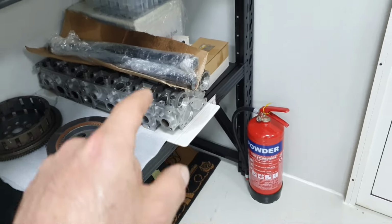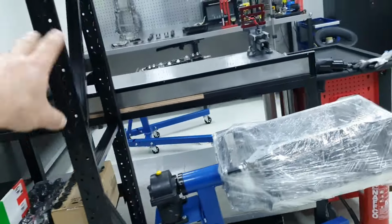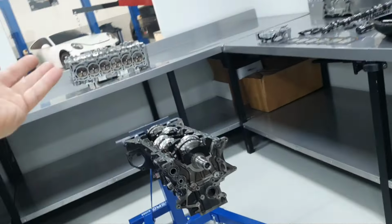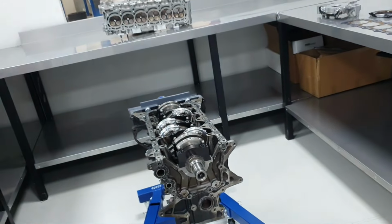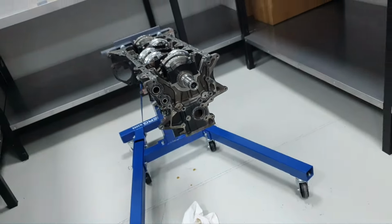I'm going to ask the owner, my friend, if I might use this cylinder head instead of this one. If there's no need for lapping, if the valves were okay and not leaking, I'm going to use that one. But why open the valves, lap them, and then have one sit more in, one more out? It makes no sense, right? In any case, let's continue.